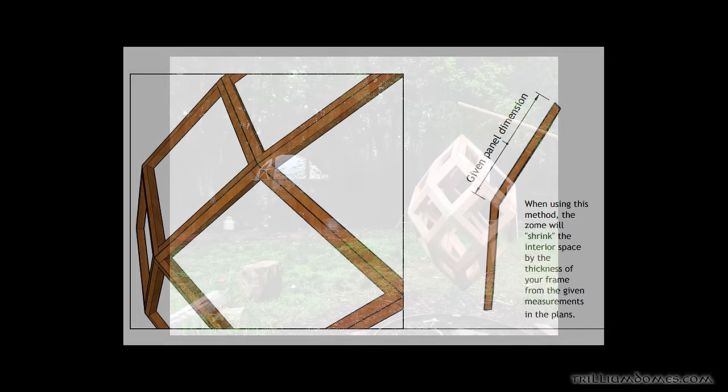That's pretty much what we got done in seven days. For the lower windows, we treated them really like operable skylights — there's a curb that sticks out of the frame and gets waterproofed in with the roofing underlayment, then the window itself sits over the curb so water sheds straight onto the roofing. There's also a flashing drip edge combo that prevents water from getting behind the window, and even if wind-driven rain ever did get behind it, that waterproof curb prevents it from dripping inside.